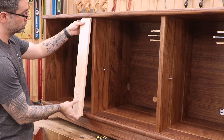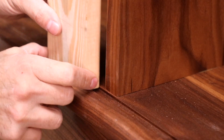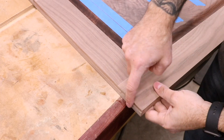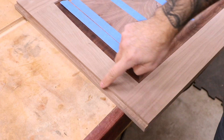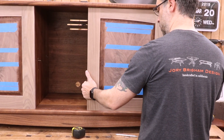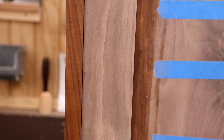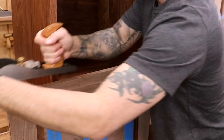The sliding doors require a little bit of fiddling to get them to work properly. I highly recommend making a test piece from scrap to confirm the total height of the doors and the dimensions of the rabbets on both ends. The bottom of the door gets a very shallow rabbet and the top gets a deeper one. When cut just right, the doors will pivot in, push up, and then drop down into the groove. When the doors are installed, I push them all the way to each side to see if anything needs finessing. I've got a slight gap at the top on the left, so I'll use a hand plane to make a slight taper so that gap disappears.